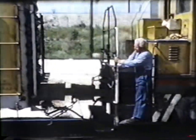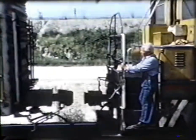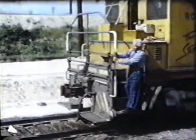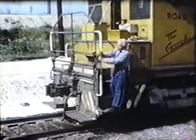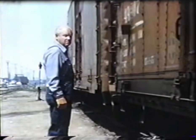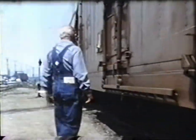There's really no good reason to ride a footboard since you can do a job like pulling the pin more safely from the step. When you're pulling pins from the ground, you're naturally walking and looking the same way the car is moving, because that's where your signs are coming from.